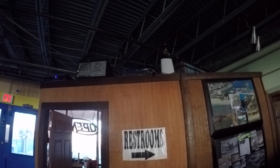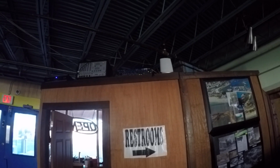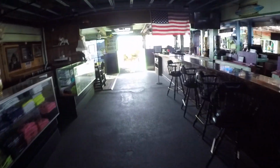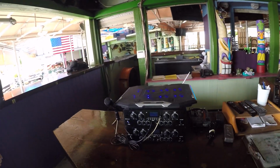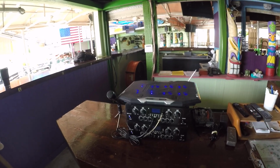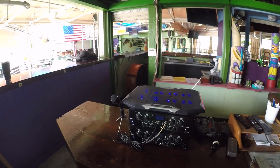I really don't know how to describe that. I mean, I know how to describe the importance of cooling. If you don't like your stuff cooked, well, make sure it stays cooled off. And placement, a lot of times, is a lot more effective than having to have some noisy fan aimed at it. And as I've shown you, your fans don't have to be noisy, and they don't have to be directly on the amps. You don't really need that much flow. If you do, you're doing something horribly wrong. You only need a few CFM. 20 CFM really blowing over a heat sink on an amp is a lot, because a lot of these amps don't even sound good until they're halfway warm, and a lot of amps only sound good when they're still cold and crispy. I mean, like anything EAR, right?